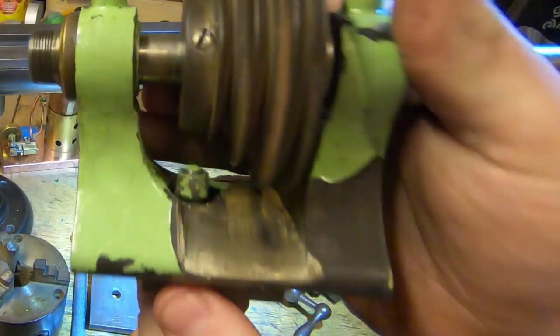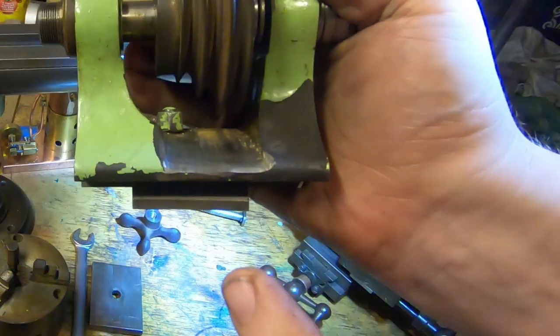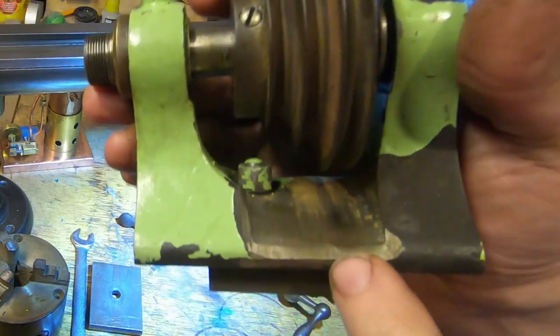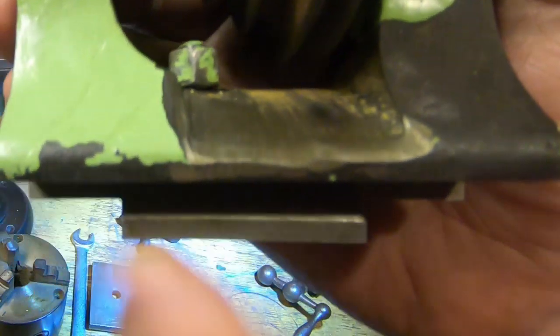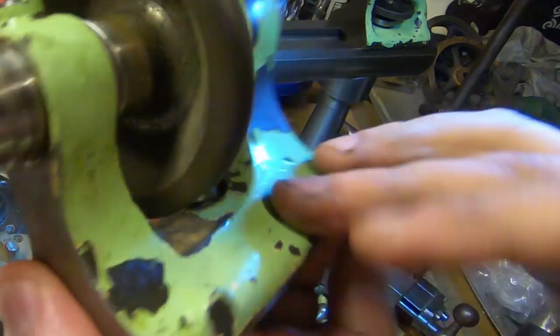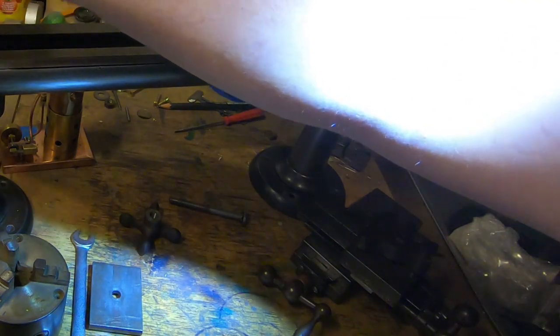This area has been abused — it's been filed or ground out because someone ran the belt off the back where it's not supposed to go. I hope I can build this up and fix it somehow, but I'm not all that confident. If anyone has ideas about how to build that up, please leave a comment. It's good-quality cast iron, it's just a real pity that happened. I might be able to find another casting to use, though they're not usually in my price bracket.